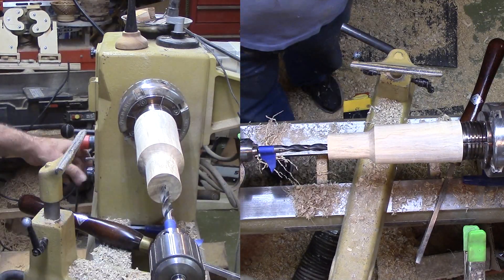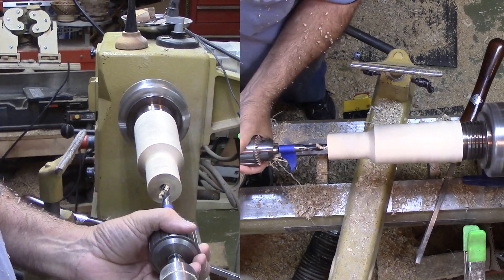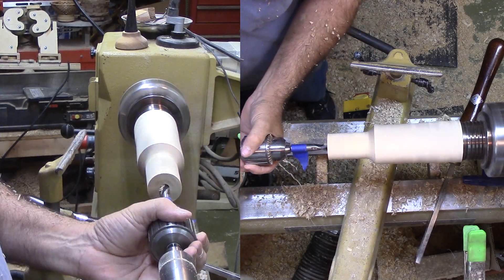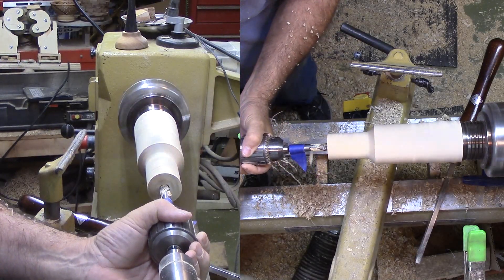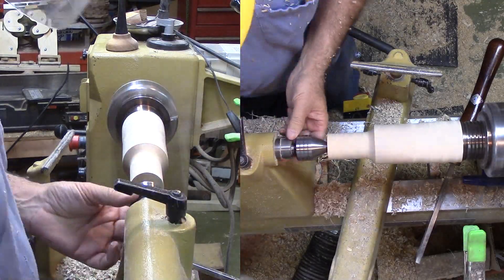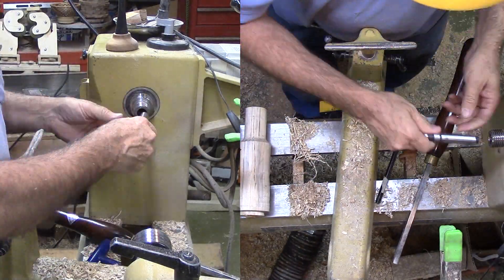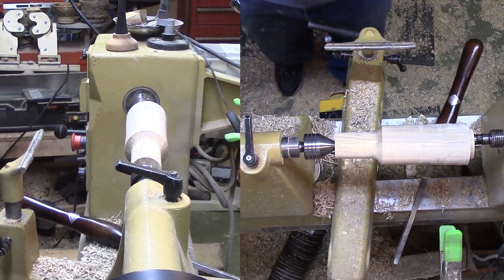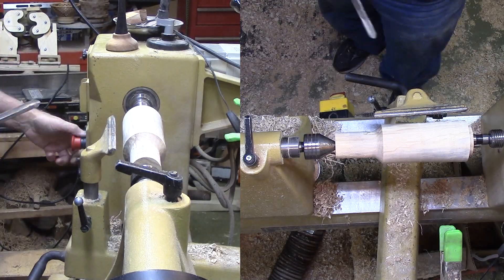Next, I need a half-inch hole for the glass tube that will hold the flowers. I'll do it now because who knows what will happen later. Then, take off the chuck and bring back the stub center. It's time for eccentric fun and it's easier to maneuver without a chuck.